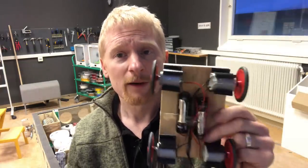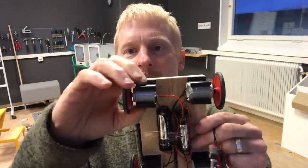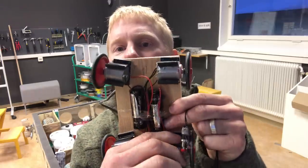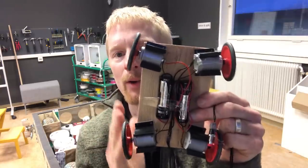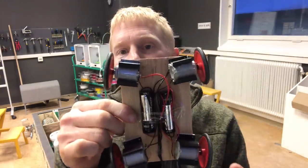On gravel road, it's actually enough to follow a normal road, but sometimes you really do need to maneuver at a tighter location than a big grass lawn. So I experimented with various ways of getting more control over the vehicle, and one obvious way is to turn your motor slightly so that if you power one side, it's going to force the vehicle in a pretty steep turn, and the opposite as well.